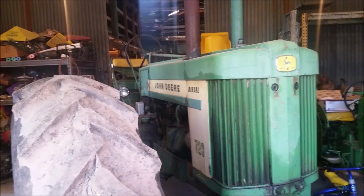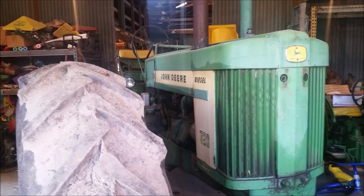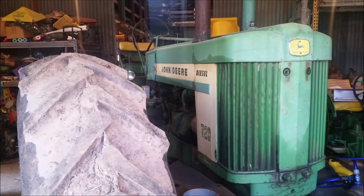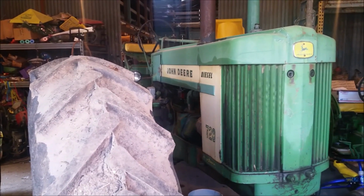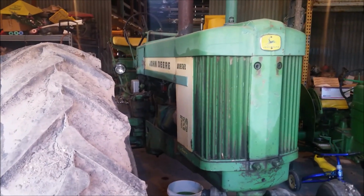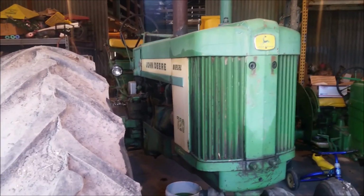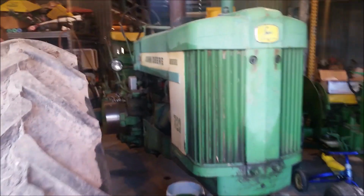We had the fuel line, we had couplings, but there was something kind of odd. Was it a 5/16 fitting, you thought? It's a 5/16 inverted flare. A 5/16 inverted flare. With a 1/8 pipe thread. So it's real rare, real hard to find, and so you kind of have to piece things together. But once you know what parts you're dealing with, then you kind of can avoid the dealership.